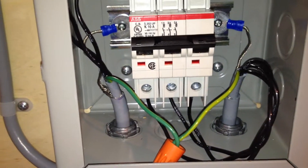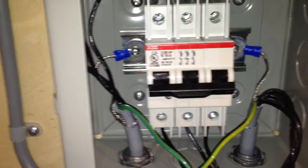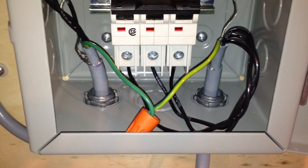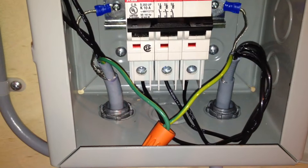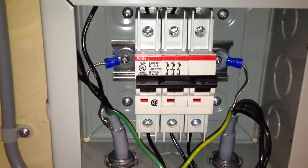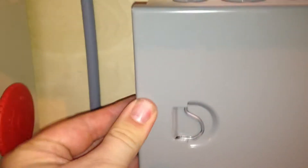The box is shielded along with everything else, so there should be continuous shielding. I'm free from EM noise. The only time this breaker should really ever turn off is during a very abnormal VFD failure or something like that. I did put this in because I think it's a 14-gauge wire and I wanted to protect this wire just in the off chance that anything would go wrong. These wires are ground, tied together with a good wire nut — not going anywhere. So shielding that's continuous, ground that's continuous, and three-phase power. As long as this is on, I really should never have to get into this box during any kind of normal operating conditions.